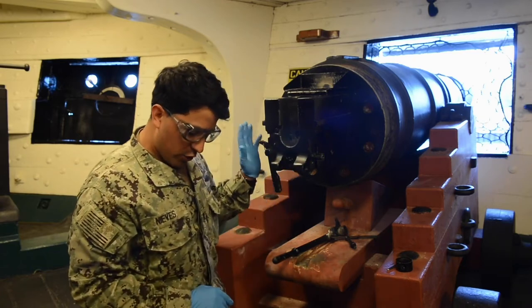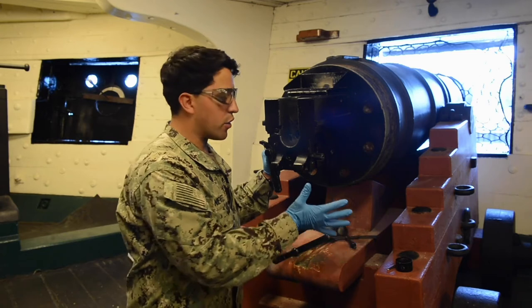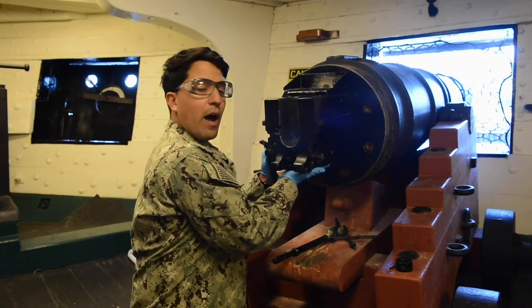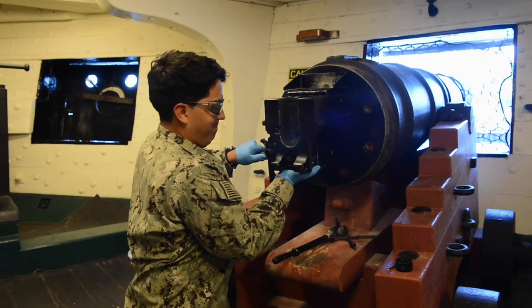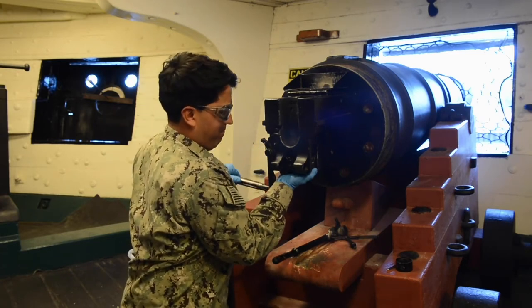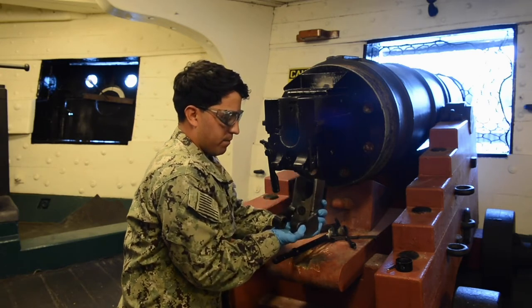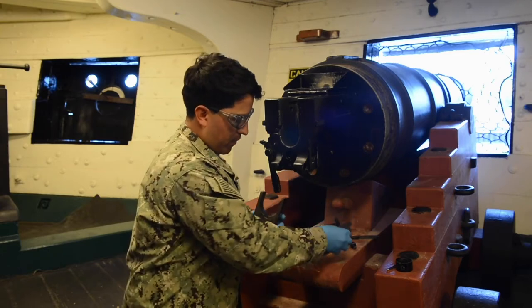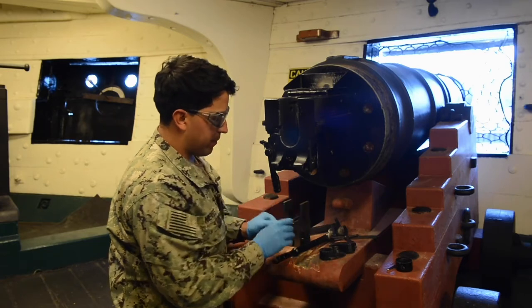So, it says, using left hand, grab onto your crankshaft. With right hand, reach under to ensure you can catch that breech block. It says, pull on your crankshaft until your breech block and your crankshaft arms fall off. Set aside our breech block for a second.